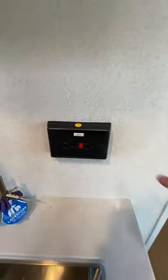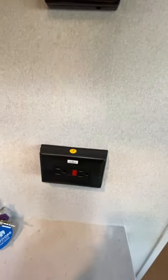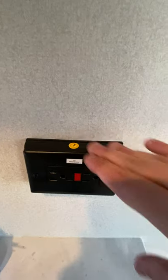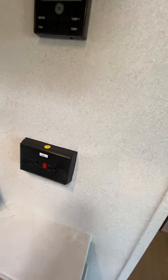One other thing you'll notice right here is your GFI outlet. This is important if you have outlets that aren't working — because you do have outlets in the kitchen and also in the bedroom. If those are not working, just make sure that the GFI outlet isn't tripped. If it is, go ahead and reset it, and that should take care of it.